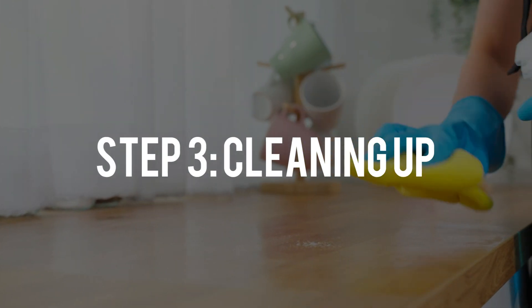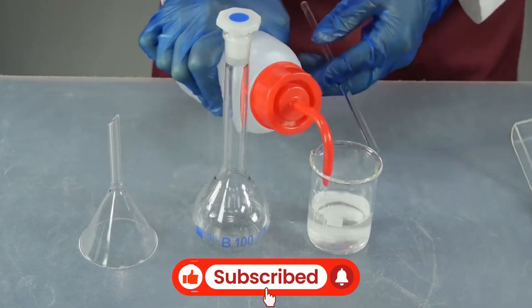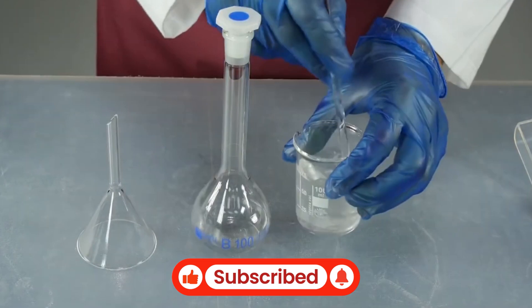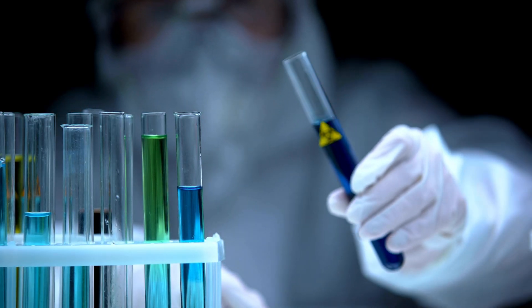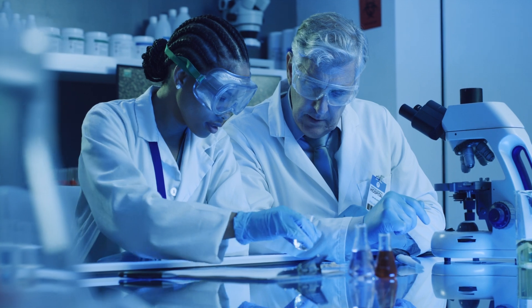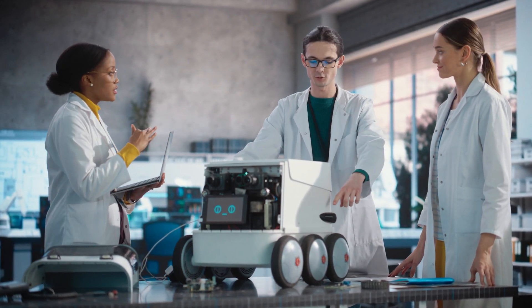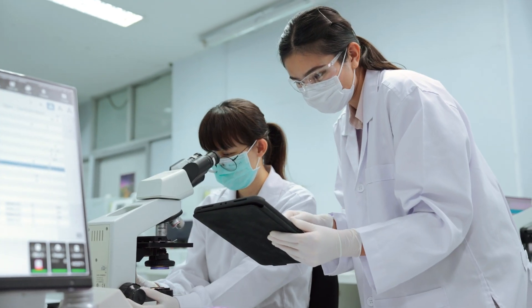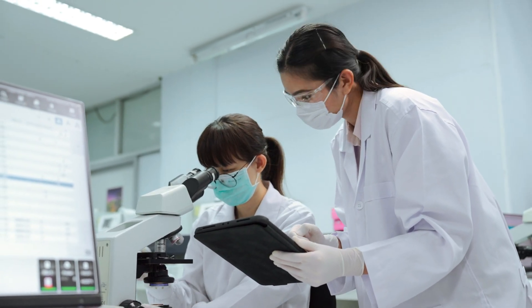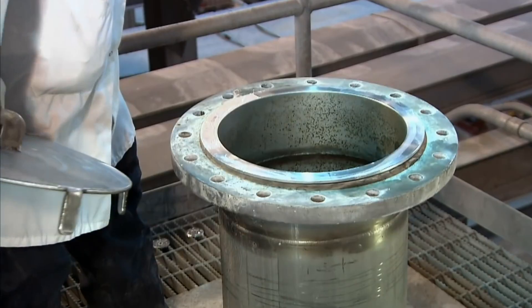Step 3: Cleaning up. After the reaction, they are left with remaining calcium chloride particles and a combination of sodium carbonate dissolved in water. The next step is filtering everything out — similar to sifting flour to get rid of clumps. Eliminating the solid calcium chloride bits yields a clean, well-kept soda ash solution, with quality closely monitored throughout to ensure everything works out well.